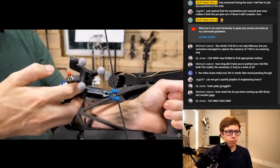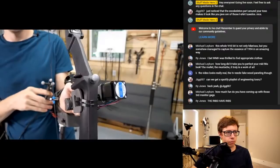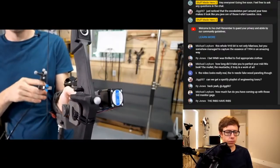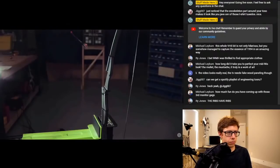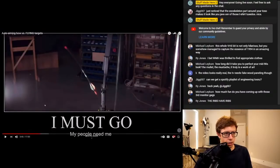Here's the little robot that releases the string. It does this with a little servo motor. It is super important that the bow always points at my back hand — if it doesn't, the arrows just don't fly right at all. The arrows with this cheapo bow look really wild when you launch them normally. These bows don't have enough of a cutout for the arrows to be in line with the string, and boy do they flex and go crazy when you fire them.